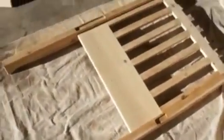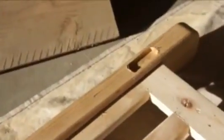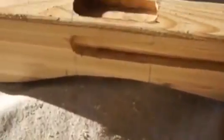Okay, now after you glue everything together, then you're gonna have to put notches into the post, as I did on this one. You're gonna have to do the same thing as on the pickets. Put some dowels in. I'd say 3 or 4, and 2 on top. And then same with this on the sides, so you could dowel everything together. And this is what it looks like, all routed. So for this side and for the tops for that piece.